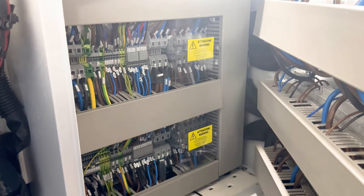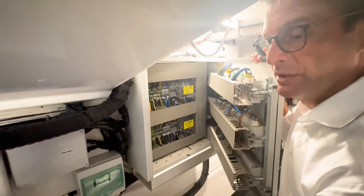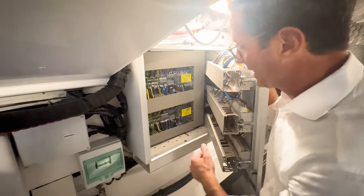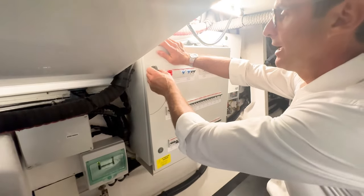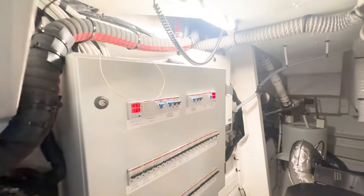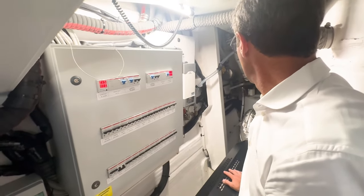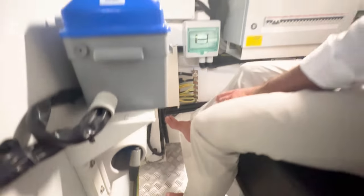We provide digital as well as paper wiring drawings, and when an electrician needs to troubleshoot issues, they just locate. Everything is nice, neat, clean, and designed and held in place in tight, watertight electrical cabinetry like this, which locks in place safely. Here you have your breakers, and these are your battery chargers, service and engine battery chargers. The other Glendinning cable master is there. You have your freshwater washdown system here, very handy to have in the engine room.